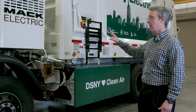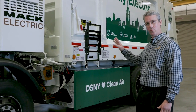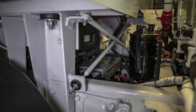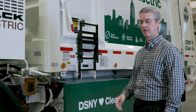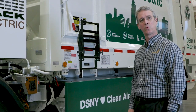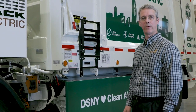These provide all the power to run the propulsion system, as well as the power to run the PTO for the body hydraulics. Underneath the cab, we've packaged all the power electronics. You've got a DC to DC converter underneath there to give us 12, 24, and also 600 volt circuits. The 600 volt circuits run the body hydraulics, and the other circuits run the air conditioner and also the power steering pump.